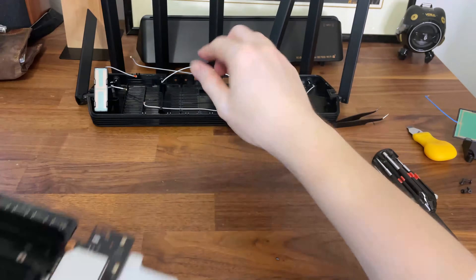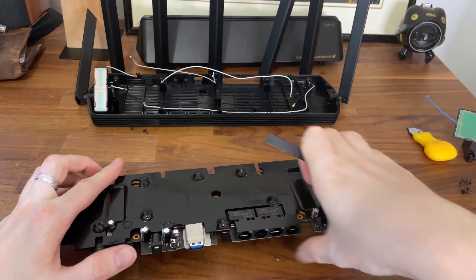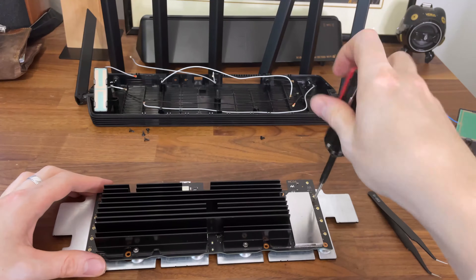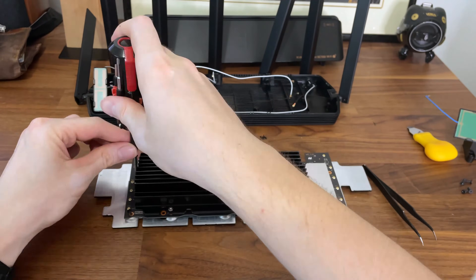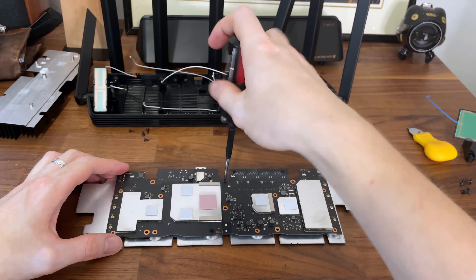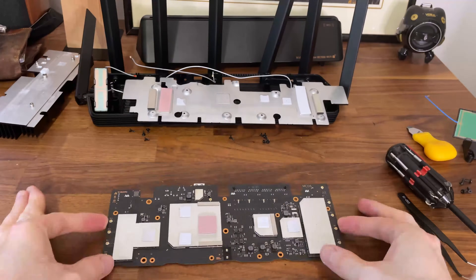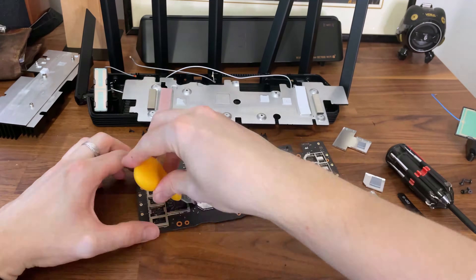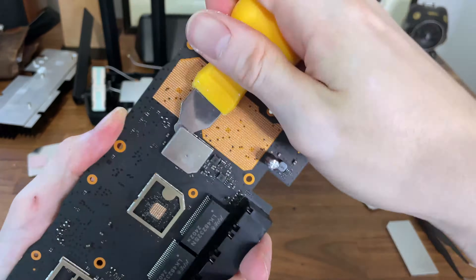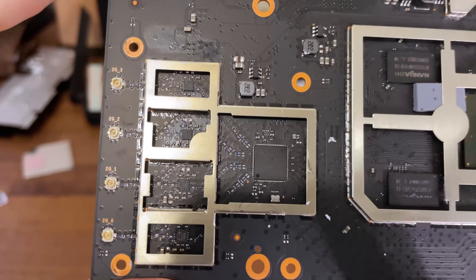Now we can get a better view of the bottom heat spreader. Without wasting too much time, I started removing some of the screws — there are quite a lot on both sides. The best course of action is to remove as many as you can reach until the heat sink at the top can be detached, then remove the remaining screws until the bottom heat spreader can be detached as well. Then it's time to remove all the aluminum covers on both sides. The bottom side of the PCB only has one main component — the flash memory chipset — so you don't have to remove any aluminum covers on that side. At the top, we can finally see the rest of the main components.